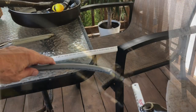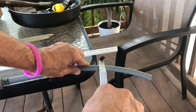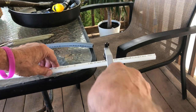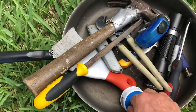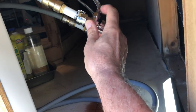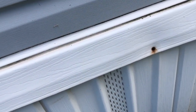I just cut that with this hacksaw blade and made sure it was nice and square. Cut the poly-B with that, and also cut my short little PEX pieces for the transitions with this. They make a tool for that, but I didn't have it, so you just got to cut it straight. I did not use tape. They suggest you don't use tape on the connection where your new faucet connects to the valve — don't use tape because there's a washer in there. And they say that's enough, and it was.